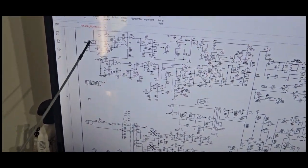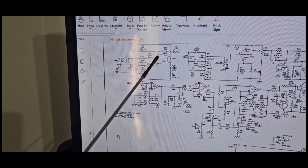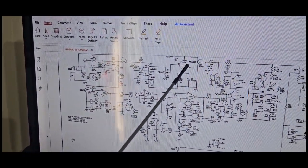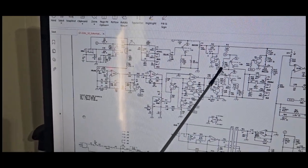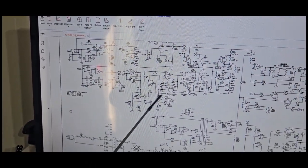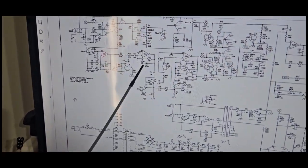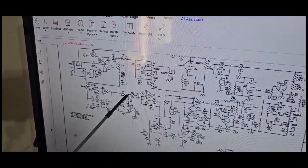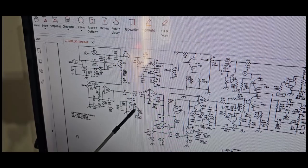Okay, on all these amps, you've got your input jack, and it hits the first side of a tube, just one side of that first tube. Then it comes over here for the clean and hits another side of the tube. What's happening is that's your JCM 800 kind of sound, because it brings in this clipping over here, and you can even see over here, there's two clipping diodes right there. Now this section right here, when it comes out down here, you're going into basically, if you look at this, that's a dual op amp, which is a single op amp that has 2 channels, and a FET.